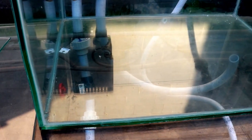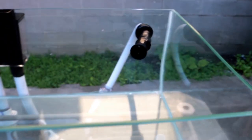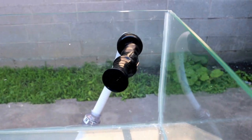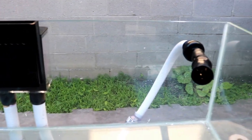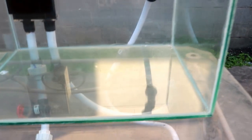The glass I used all around is quarter-inch, but the bottom glass is five-eighths of an inch — I went with thicker glass for the bottom. All the glasses are tempered except for the back panel, because I needed to drill holes into it and you can't drill tempered glass. So the back glass is the only non-tempered piece; all other four pieces are tempered.